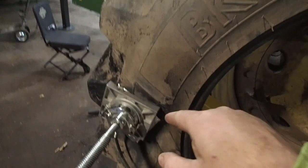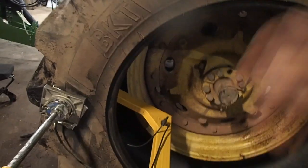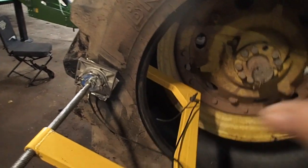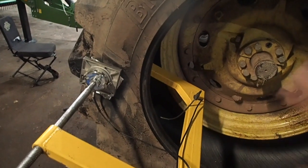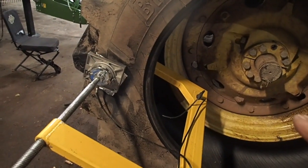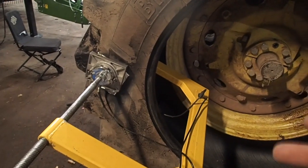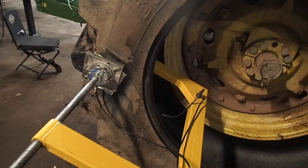I did fill that. There's two different types of gum. You have treadwall gum and you have sidewall gum. Sidewall gum is much more flexible than treadwall gum. Or, treadwall, it's cushion gum. They call it cushion gum. So I put the sidewall gum in there because I should have put some cushion gum over the top of it, but I did not because it's okay. It won't matter. All it's got to do is protect the rest of the inner workings of the tire. And I think we're going to accomplish that.